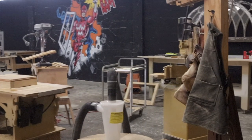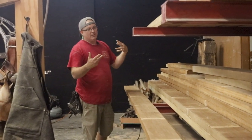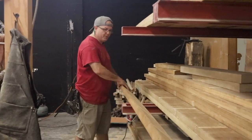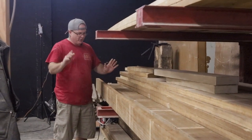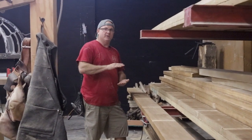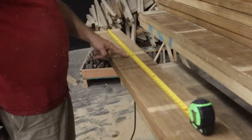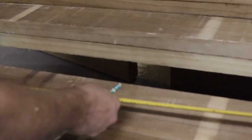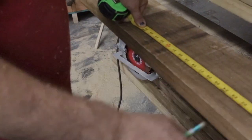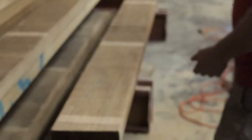Here we are in the back of the shop. I've got a nice stack of rough lumber. A typical residential sash is an inch and three-eighths thick, so I'm going to start off with this piece here — it's called six-quarters. Four-quarters is one inch; six-quarters is inch and a half, give or take. We're going to plane it down to an inch and three-eighths. I've got 24 and a quarter inches high, so I'm adding about four inches to account for snipe. My width is 30 inches, so I'll call it 34. I'm going to take my circular saw and cut it to rough length.